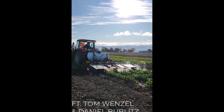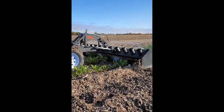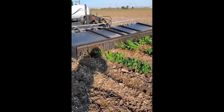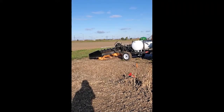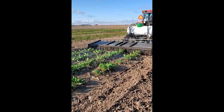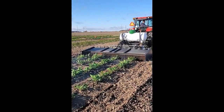Alex, we're going to go to a video that you took of the burner operating in the field at the end of last year. Can you describe to us what we're seeing in this video? So we start by powering up the burner, and then we lower the flame over the beads and heat the beads to about 1200 to 1600 degrees Fahrenheit.